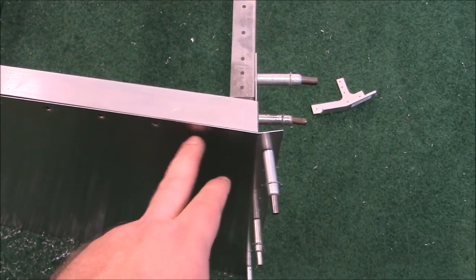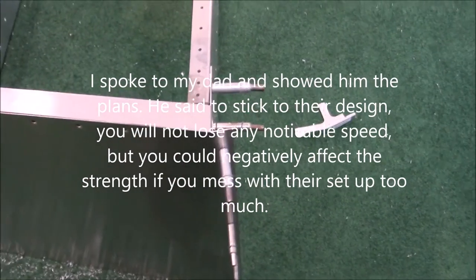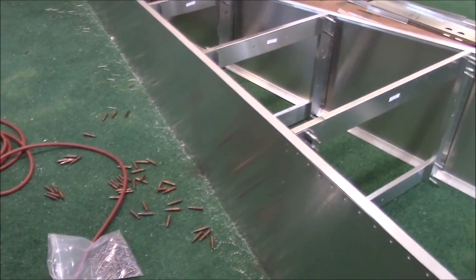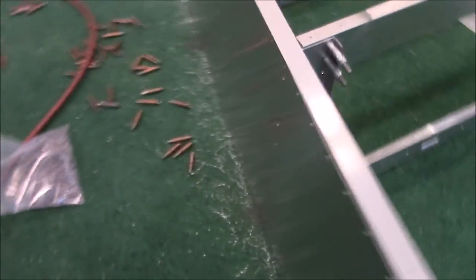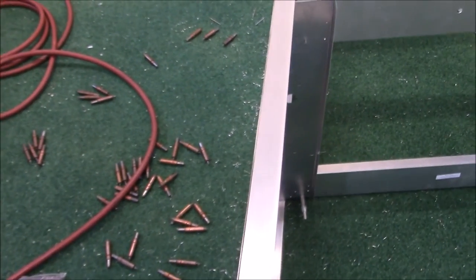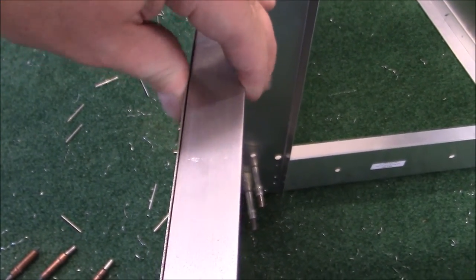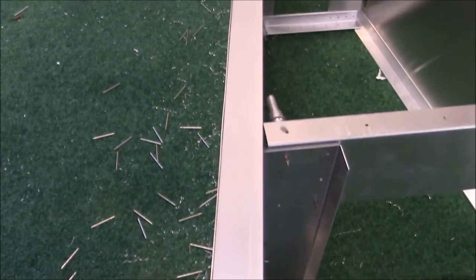I'm not going to rivet from this section forward because I'm trying to figure out how to do these bolts that will go through here — I want to do everything flush, and the bolts they suggested have heads on them, so I need to figure out exactly what to do with that first. But I'm going to start pulling the rest of the rivets because the rest of the plans make sense for what I'm doing. Got that side completely riveted, minus the ones I told you not to. The rivets came out very nice, perfectly flush. If you look at the skin where it meets the longeron, there are only one or two very light areas where it's a hair wide, but all the rivets went off properly. I'll keep working on the other side now, but I think I'm going to call it a day. Thanks for watching.